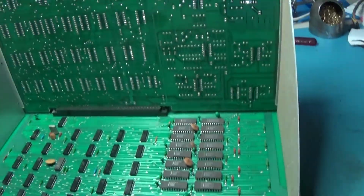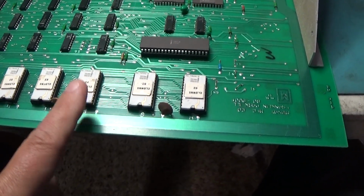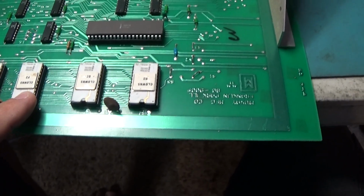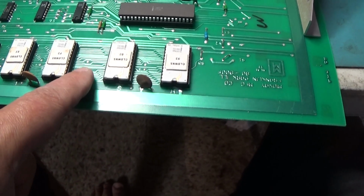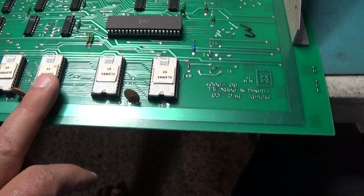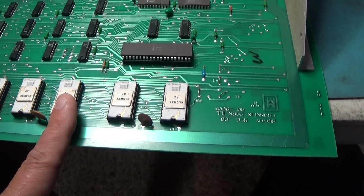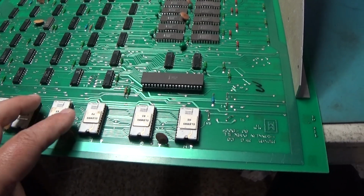And we'll have to solder some stuff. Replace caps. These look like, no, they are not strapped as 2716s. It doesn't look like it. But at the same time, we don't have little tantalum caps right in here, so that tells me it's not a tri-voltage ROM, because usually these caps will be in if it's a tri-voltage ROM. But I think these might be a tri-voltage ROM anyway. They might just not need, well, I don't know. This looks like it's strapped for a tri-voltage EEPROM, so I think that's what's in here. And I'll have to pull the Fluke data for this if needed so that we can test these.